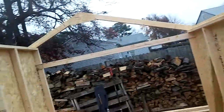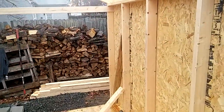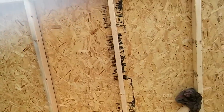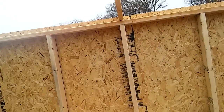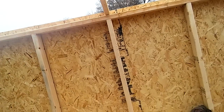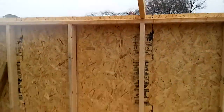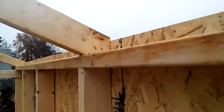On the roof system, a couple more things need to be said. I've got my gables on, and the next thing I usually aim for is a center rafter — especially on a 12-foot span. On anything longer, eight foot isn't that bad, but if the plates are bowed out it makes it harder to put together since the other rafters get in the way. On a 12-foot shed I always go for that center because it has one in the center, and on 16-foot I'll go with a couple.